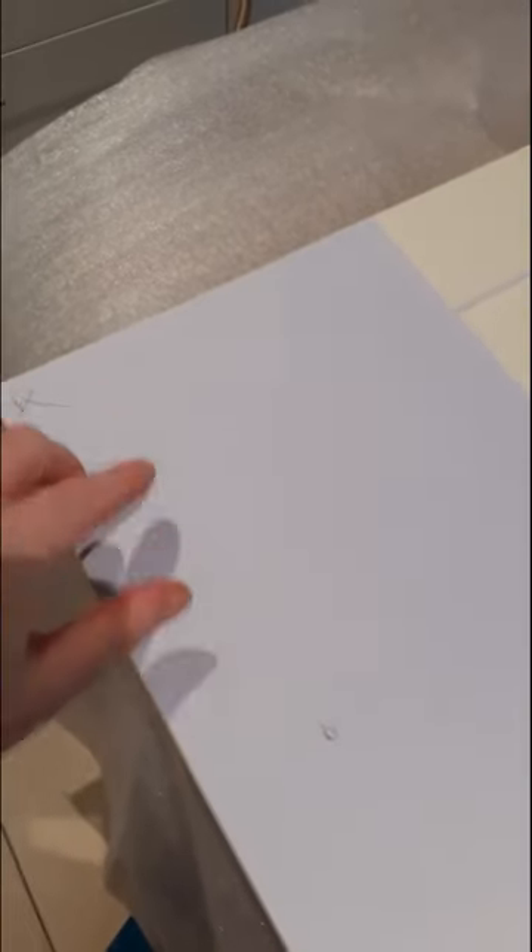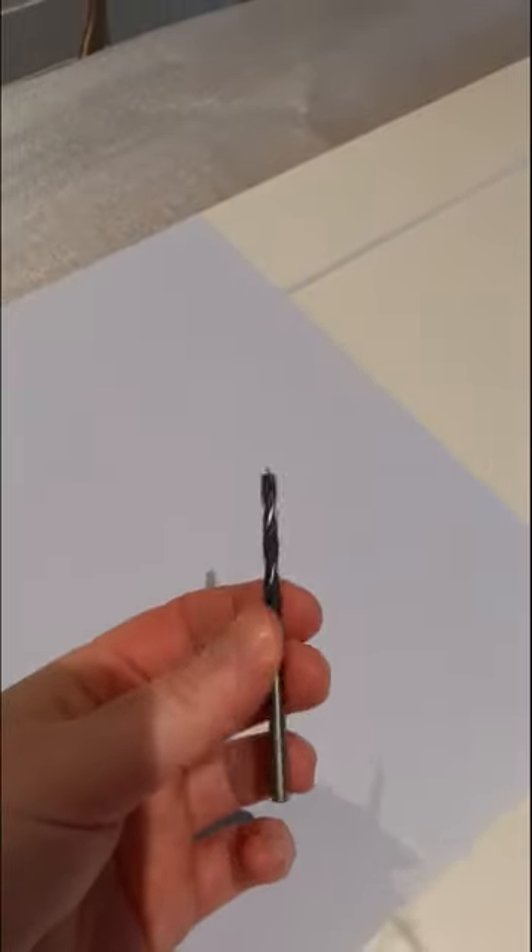I've put this new door on my worktop and I'm going to line up my template onto the door and mark where my holes should be. Once I've done that I'm going to use a 4mm drill bit - this one is for wood. Make sure it's a pretty good drill bit; hopefully you can see that the tip is nice and sharp, otherwise you may ruin a little bit of the surface of the door. So I'm going to go ahead and drill.